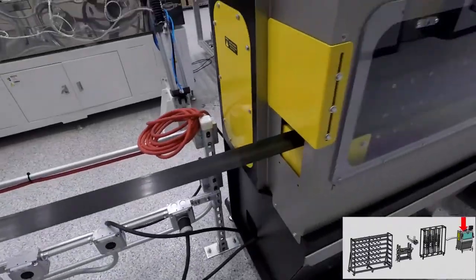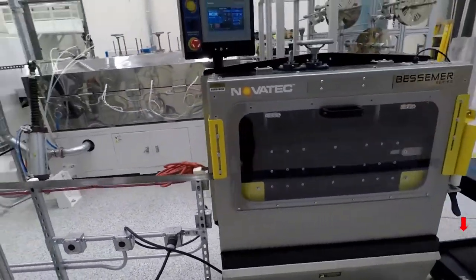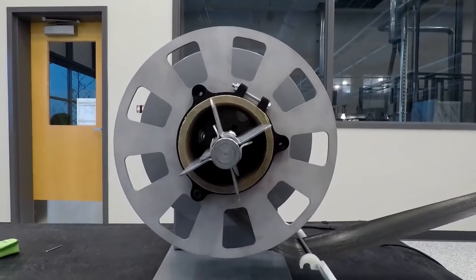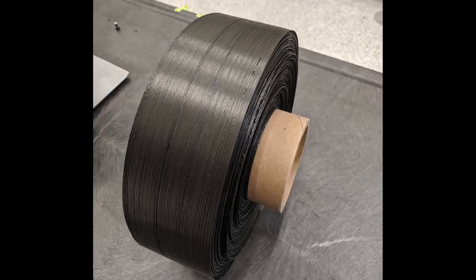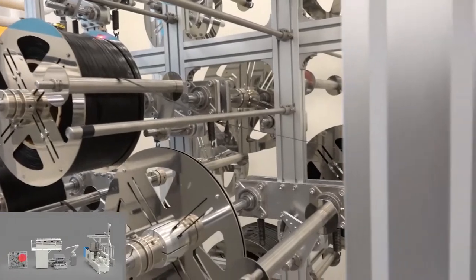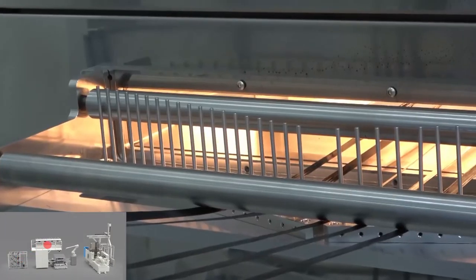The whole line is driven by a belt puller. The tape is wound onto a roll for use in other processes in the MD Lab. Here is a finished roll of material. The prepreg tape is used elsewhere in the MD Lab — one such example is the key tech cell, which creates composite preforms for hybrid molded parts.